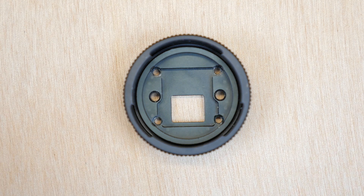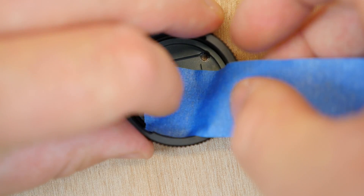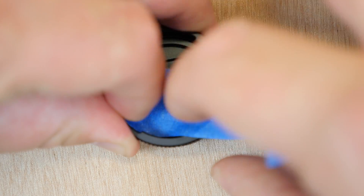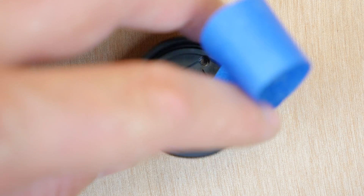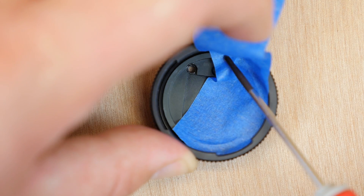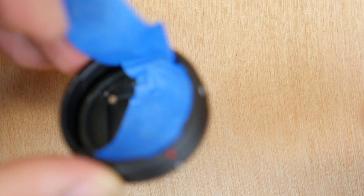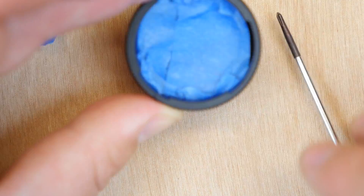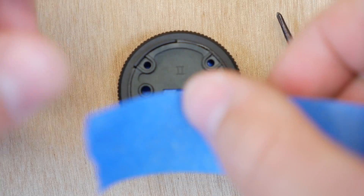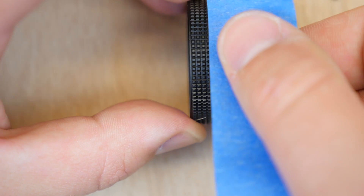For this project, you're going to want to work on a flat and clean surface. Because we're going to be shaving off some of the metal on this bracket, we want to protect the inner parts of the bracket. The center of this little tiny piece actually comes out and there's some grease in there, and we really want to avoid any metal shavings getting in there. The easiest way to do that is to take some tape and put it on the inside, then flip the bracket over and do it on the outside as well. We're just using blue painter's tape here — you can use any kind of tape you want, like duct tape or electrical tape.